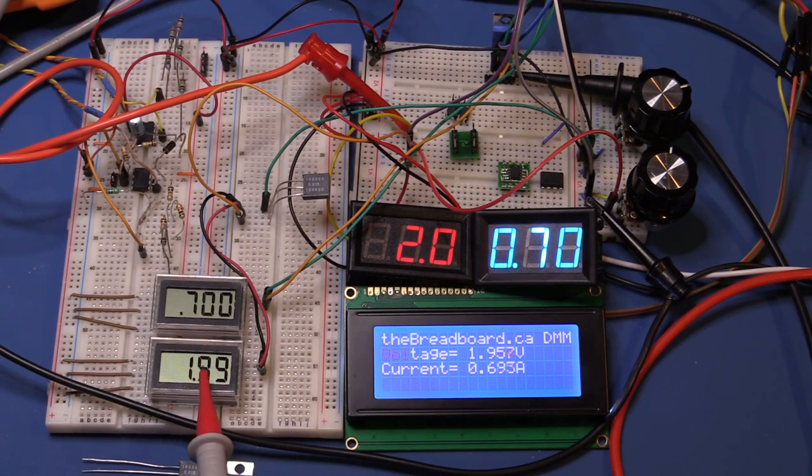The third display is the LCD driven by the Arduino. The voltage line is flickering slightly because I'm using the internal five-volt reference, which is a little unstable — that's why the last couple of digits are flickering. Nevertheless, it demonstrates quite good resolution. I'm using oversampling and decimation to increase the ADC resolution from about 4.8 millivolts per count to just over one millivolt per count.